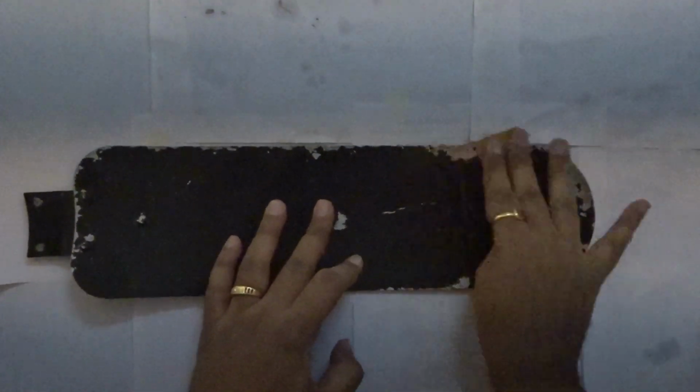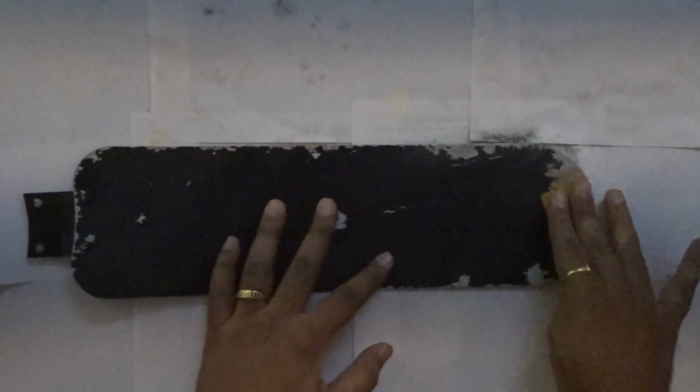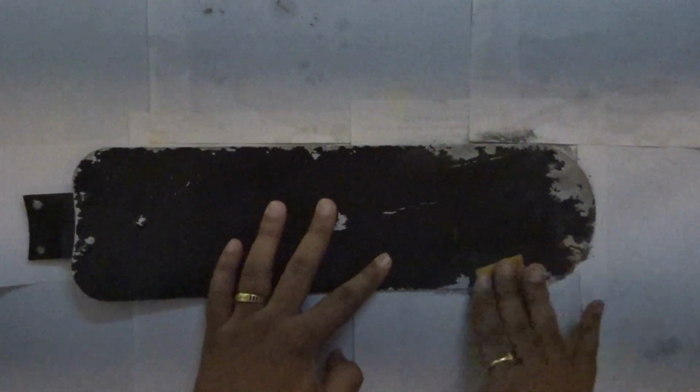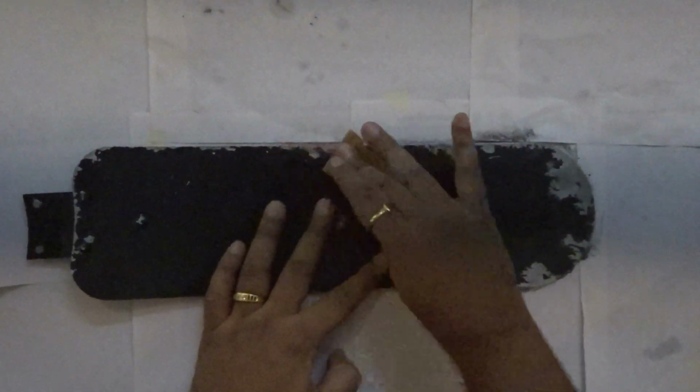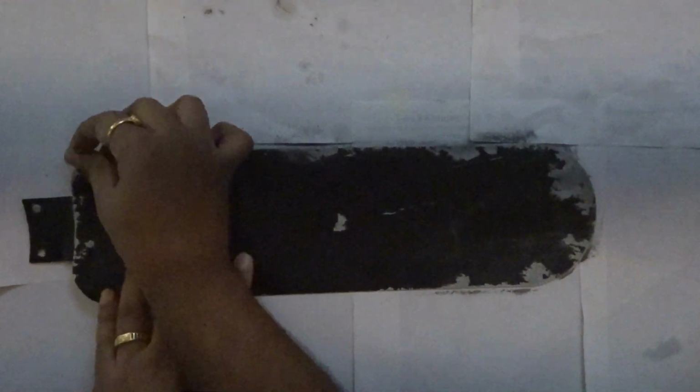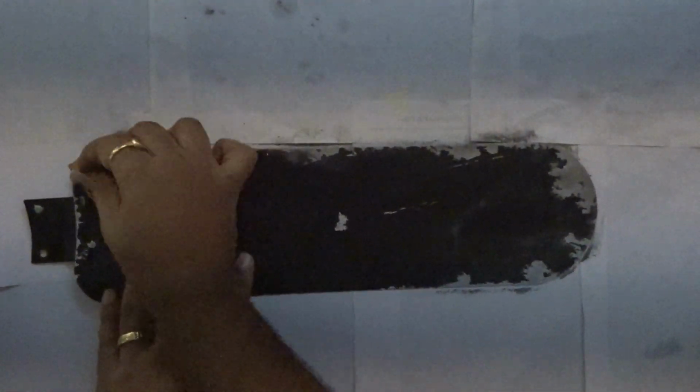First, clean the metal surface with a clean cloth. Start by making the surface smooth by scrubbing with sanding paper. We have used 320 number sanding paper. Sanding of metal surfaces helps in removing rust particles and allows even application of paint. Ensure that all scaly areas are sanded properly and the surface is smooth and clean to apply the spray paint.